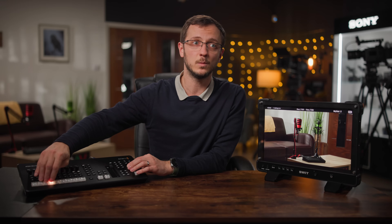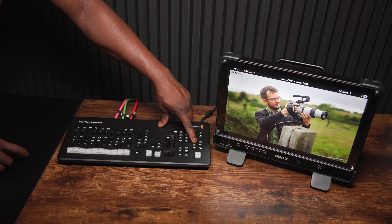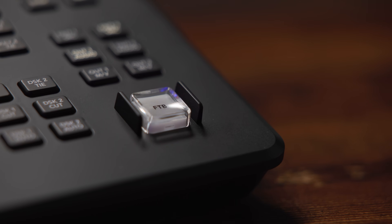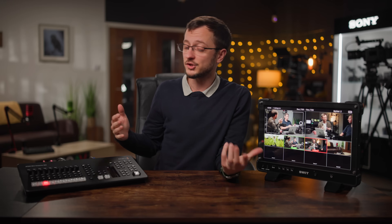There are new buttons that control two of the three outputs — you can select a source, your audio control panel, or your multi-viewer to be sent out over the HDMI port. Hold the source button down and use the main input buttons to select which source shows on that HDMI output, or use the preview or cut buttons to show preview or program. This is really useful and can even let you use one or two outputs as a small router to drive screens at events, cutting independently of your main live stream. Underneath is the fade-to-black button, moved away from cut and auto with guard rails on either side to prevent accidental presses.